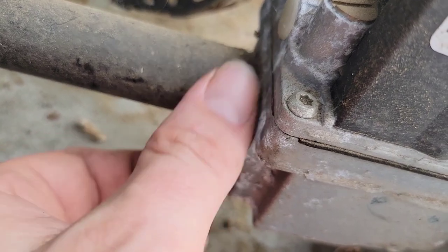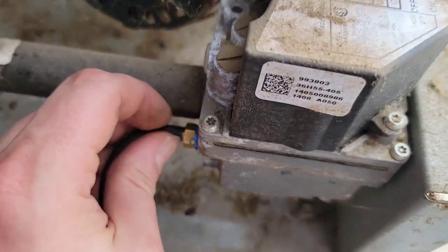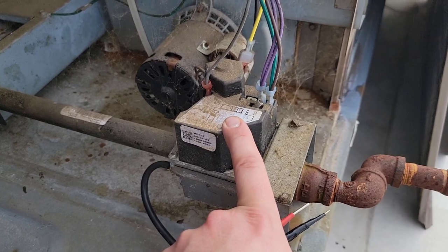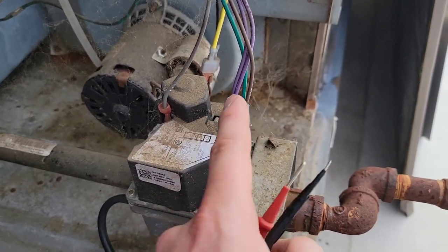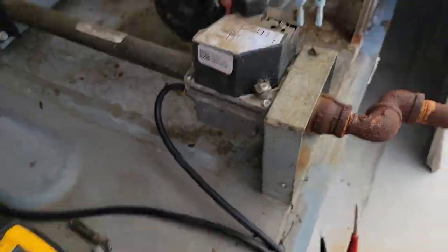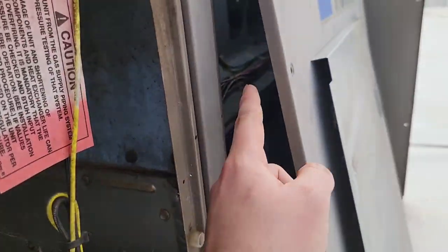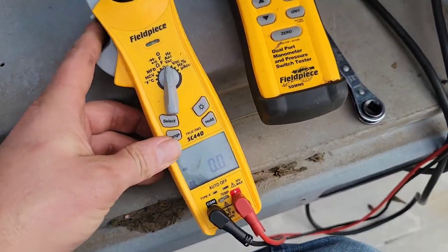I put the port in the hole and attached the tube. Make sure the gas valve is on, manometer is on, power is on, and thermostat is set to heating. Whenever our gas valve opens, it should have 24 volts going to these two wires — usually labeled C and M, Common and Main valve. I need to hook my meter leads to these two connections and turn the meter to volts AC. The inducer motor should come on first, then we close all the safeties including the pressure switch, rollout switch, and limit switch in the blower section.